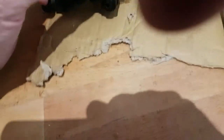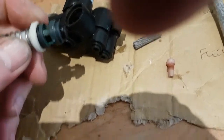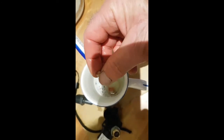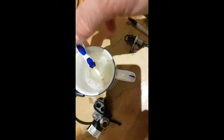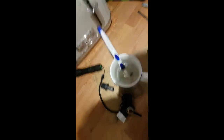This valve bit we can remove. It's not all gammed up. I've took both of the injectors out — as I said, I can blow through them so they're not blocked. Just cleaning them with fairy liquid and warm water, that's all.